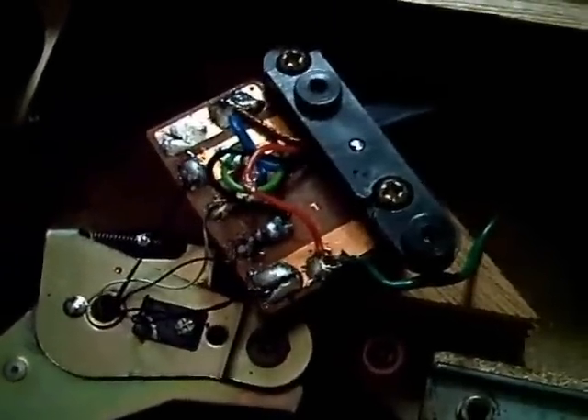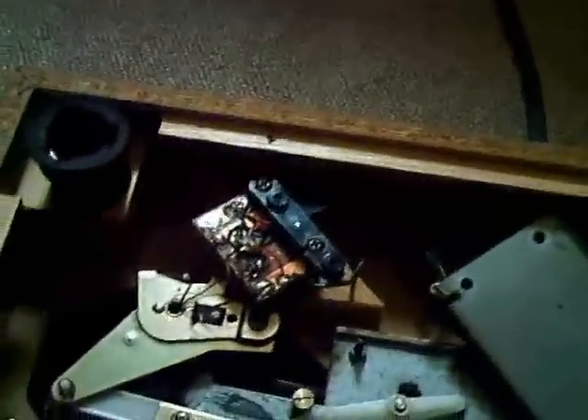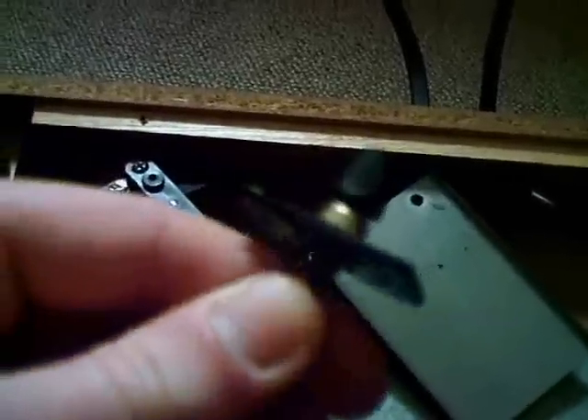I'll have to work on this. I have to put it back into the original shape. I will not replace this wire with another wire like this, directly hooked up to the record player. I will use normal separate RCA jacks, and also this ground connection, this separate thing. I'll put that all right here.